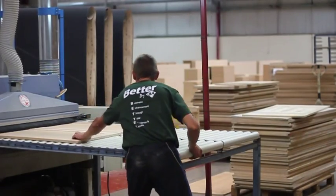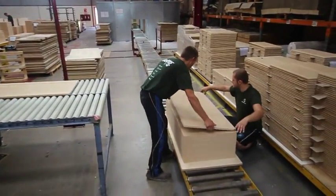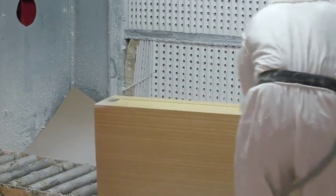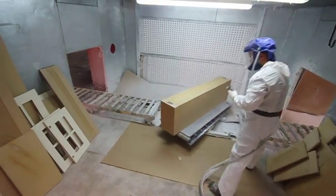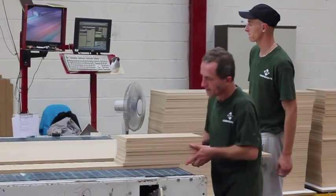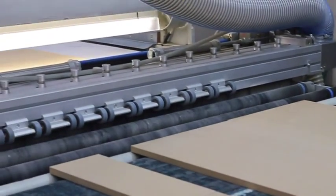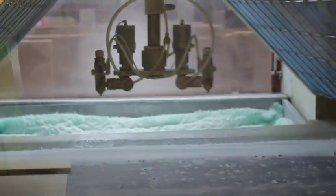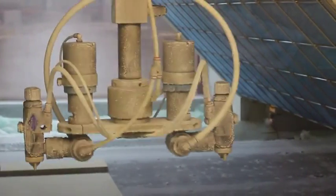Doors are sorted by size and carefully stacked in preparation for having the edges spread. All four edges are spread with a two-pack adhesive in two spray booths to ensure all four edges are spread twice. Doors are then fed onto one of five gluing and pressing lines in our factories. The front surface of the doors is spread with the same adhesive, this time by robotic spraying equipment designed to ensure an even and constant spread of adhesive throughout the surface.